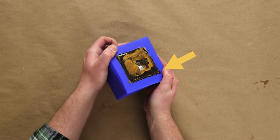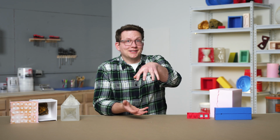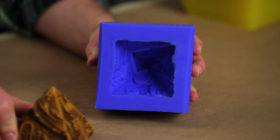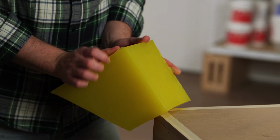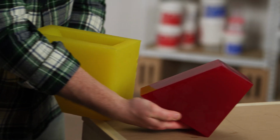As we stretch our silicone, we are introducing air between our master and our mold. The last area to separate is usually the top of our master that's actually located at the bottom of our mold. We may have the sides completely free, but still need to address the bottom. If our silicone is flexible enough, we can reach down inside and dislodge our master and finish the process. However, this isn't possible every time. In these cases, pressing the bottom of our mold against a corner of a table or another surface can assist in dislodging the final section of our master.